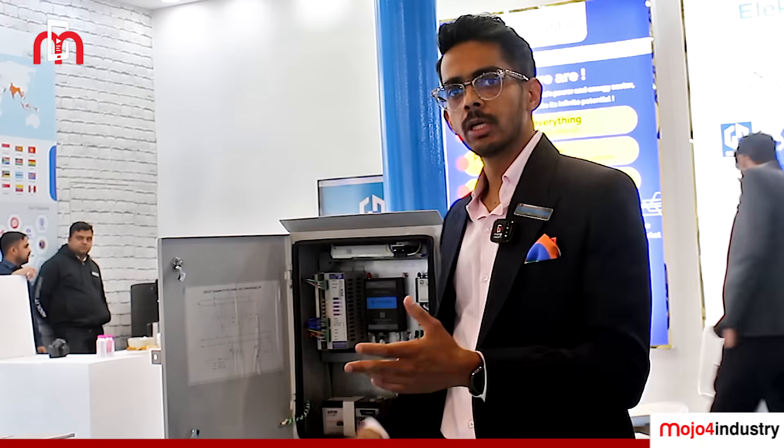Through RF communication, it sends a message to the control box. Inside the control box modem, we can have a SIM card, a LAN connection, or a Modbus connection. Through IEC 101 or 104, this sends the same data to the control room, telling it where the fault is, what magnitude of fault it is, and what type of fault it is. Usually, it takes 3 to 4 hours or even up to 10 hours to identify the fault depending on terrain and timing. This particular product helps reduce that time to just 10 seconds.